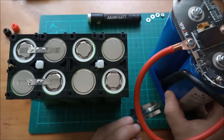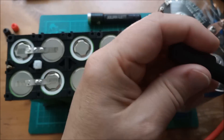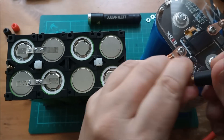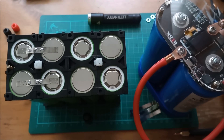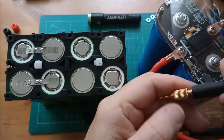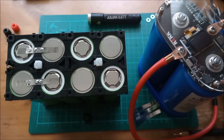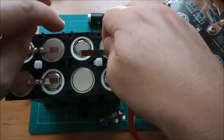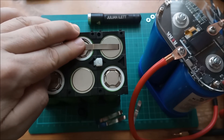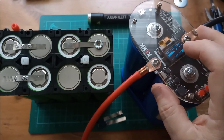I think I'll use the supercapacitor spot welder for this because I haven't used it for a while. Let's get that all in shot — take the felt tip pen caps off and let the probes slide out. Okay, that's the negative probe and the positive probe. I've cut some 50mm strips which should fit across there, and what I might do is hold one end on with a magnet while I spot weld the first end.